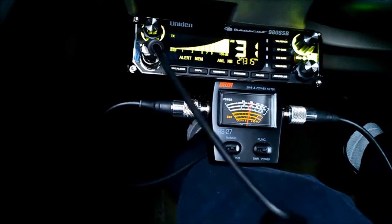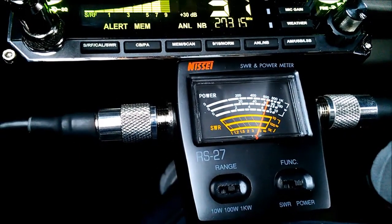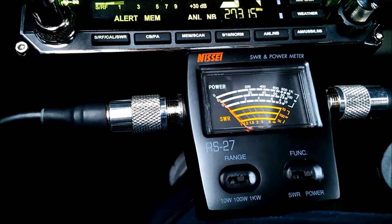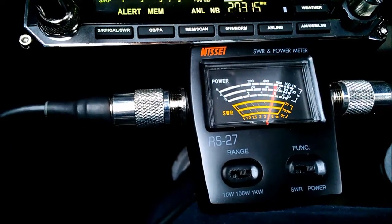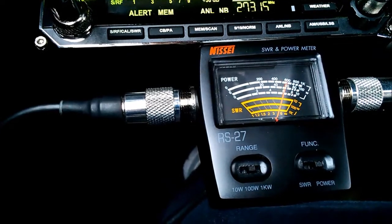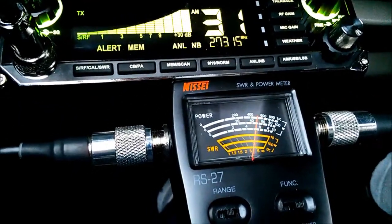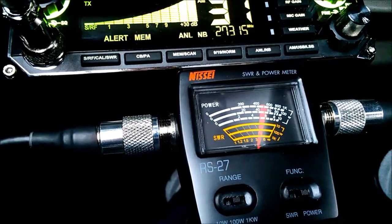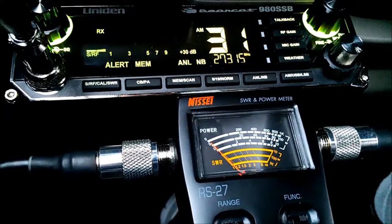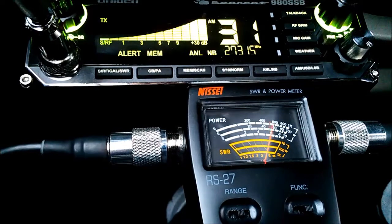Testing — no battery. Hello, one two, one two — check. Night owl, 10-10, for all your check. I got a HiGear HGM75 power mic. I was doing some probing on the radio and found that pin number six, which is normally unused, has volts coming out. So I got rid of the nine-volt battery, rewired it, put a six-pin connector instead of the four-pin, and now the mic is running without the battery.